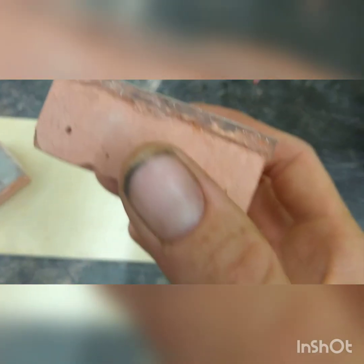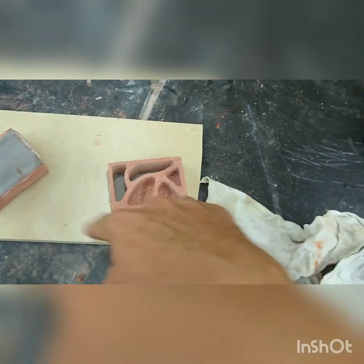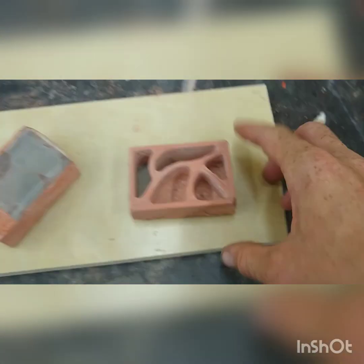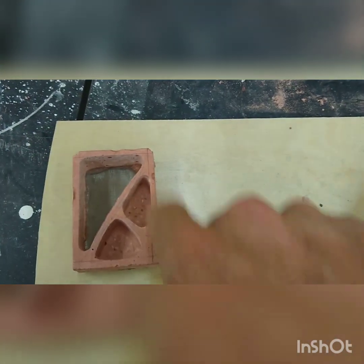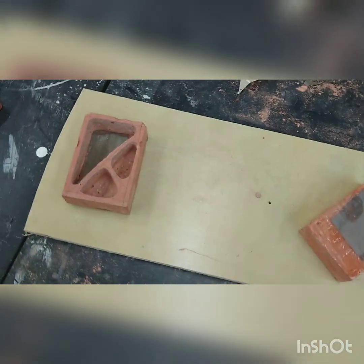It will make everything ooze out — you don't want that. Because you're going to be putting glass up against this; this whole thing is going to be surrounded in glass and have glass on top. So you need to trim it — I just use scissors, trim it up. It doesn't have to be too neat, it just has to be smooth along these walls. Any little protrusion and the glass won't sit flat. So this part is now finished. Then we have to put glass around it and put a little epoxy resin in to fill in any imperfections.